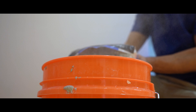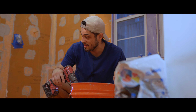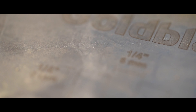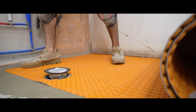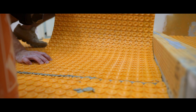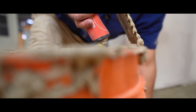This is going to be the first of many thinset mixes — it's going to be a lot of thinset. Since we're installing on top of a concrete subfloor, I'm going to be using unmodified thinset mortar. I'm going to let this thinset slake and then we'll start installing the DITRA. The one thing I've learned over time is always use the right trowel size, otherwise you won't get the appropriate coverage. I'm going to be using a 1/4-inch by 1/4-inch square notch trowel and the thinset mixed up nice and wet. This is a race against time because the drier this thinset gets, the less sticky it is and the less coverage I'm getting — that's why I pre-cut everything instead of cut as I go. Schluter recommends 100% transfer of thinset to the back of the fleece on the DITRA mat. Keeping the thinset wet gets better results. This isn't a hard step, but it is a critical step. Without good installation, the tile could crack later on down the road.